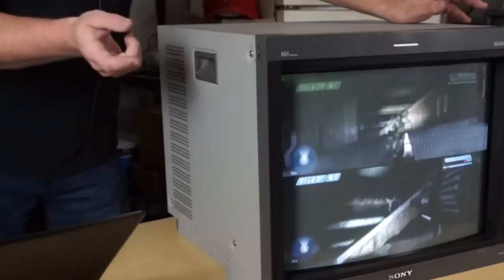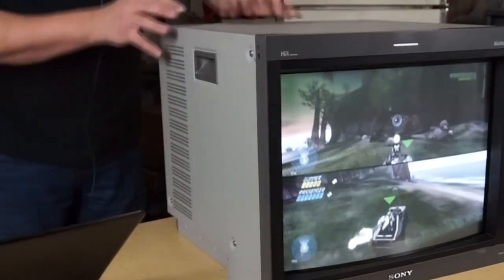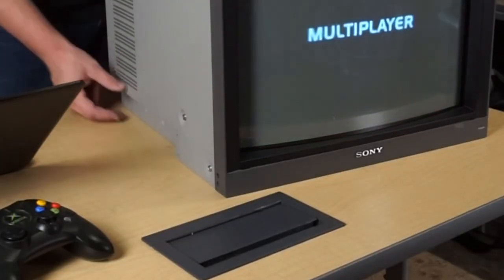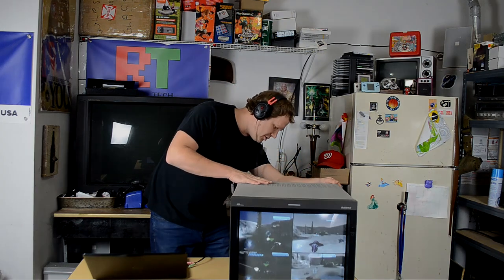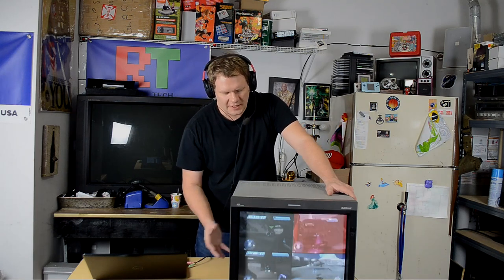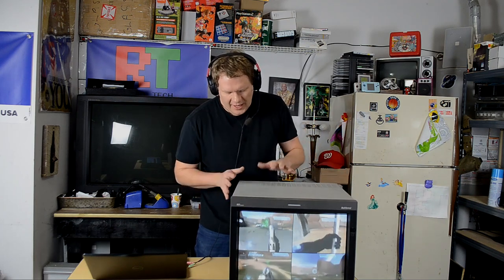Now, some of the problems with this monitor are the fact that it was still a PVM, so there's still some plastic inside. And again, another interesting design feature is there are a lot of air holes on the sides and the top of this CRT for it to breathe. But then it's got about a 2 or 3 inch gap where it's solid along the entire bottom, just about. And so what tends to happen is this one, for example, is from 2002 or 2004. So after 16 or 17 years and it never getting any servicing, dust will get into these openings. It will land on parts in the board, and eventually it builds up so bad in this particular monitor just because there's no way for that dust really to get up and out unless you clean it out and open the shell and get it off and clean it out.